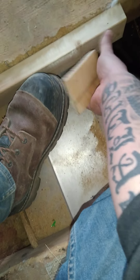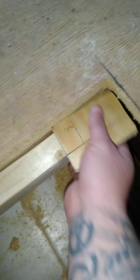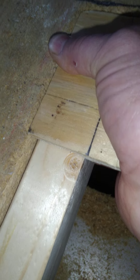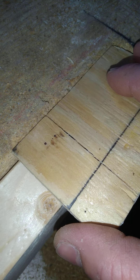So that's basically it. Like right here, I put my little jig long ways and you can see it's nice and flush. I'll show you — I'm not going to screw this down since this is just an example piece. Basically, I take it and start on one side, get that little piece flushed up just like that, hold it down, and then pop a screw in the side. That'll make it so your smaller size plywood sits in there nice and flush.